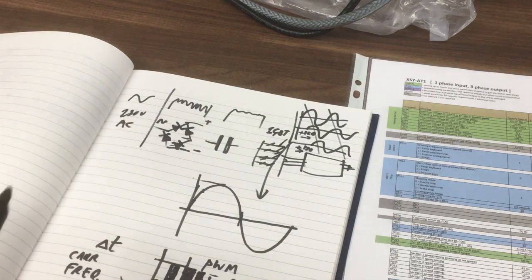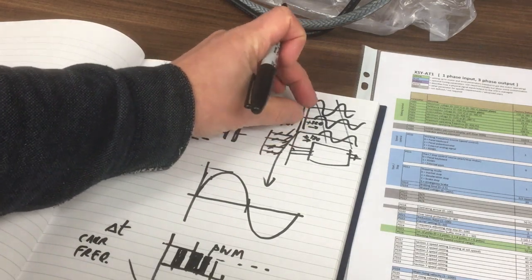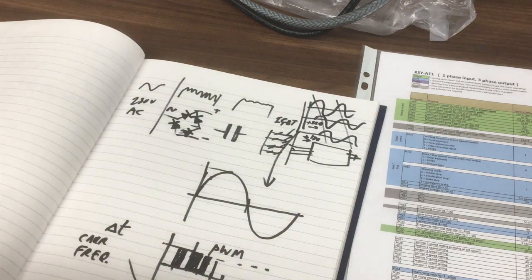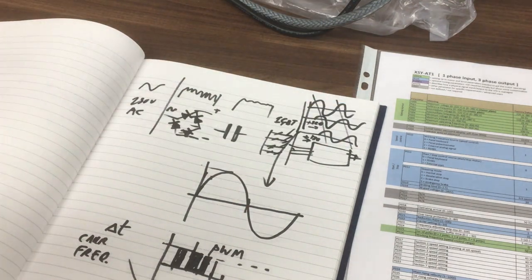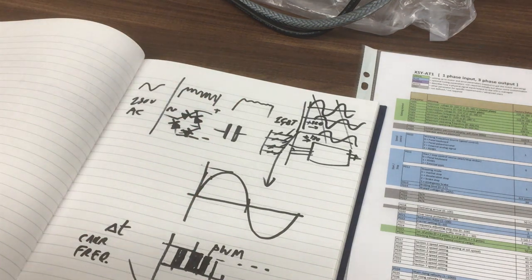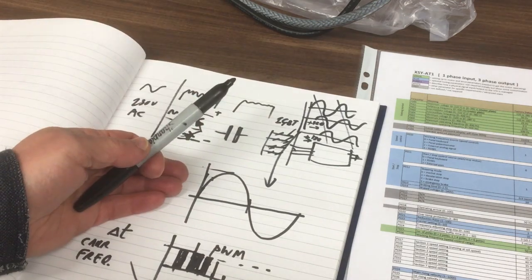What we didn't really talk about was the control and how the speed is varied. So in addition to that, well, we need to change the frequency. So a higher frequency makes the motor turn faster. There's a bit of a downside or something you've got to watch there. As you do that, if you keep the voltage constant, I believe the way it works is you saturate the magnetic flux, and therefore the motors don't work properly. So what you end up having to do is, when you vary the frequency to vary the speed, you also need to vary the voltage.